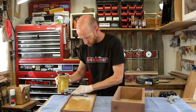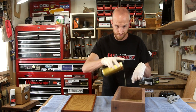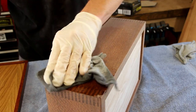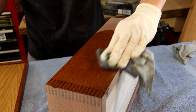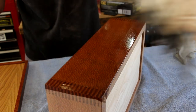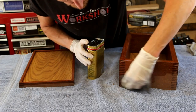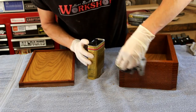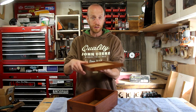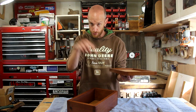I'm using a satin poly for this. After three coats of wipe-on poly and sanding in between coats, this is looking really nice. It's got a nice satin sheen to it. It is time to put all that hardware right back on.